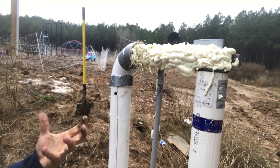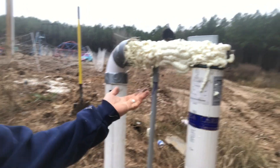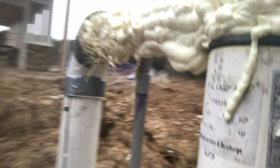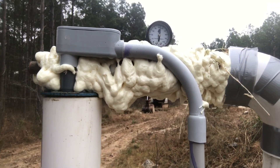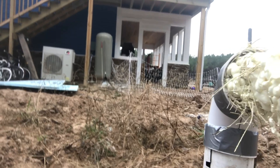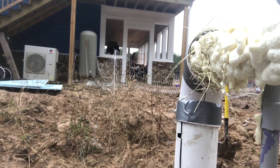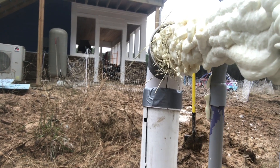You have to be careful because when you first put it out it's real runny — it'll just fall under its own weight — so you've got to give it some time to set up. Work an area, then move, work an area, then come back and work it. Underneath was the trickiest part; you can see how it really sagged here. But if we look up under there — it's all fully encased. Oh, there's a spot I missed — there it sagged. I'll come back and hit that. I've got one more can of foam. I'm going to come back through and touch up; first I'll fill this void here. I'll go around and touch up anywhere I can see bare pipe. Up there on the pressure tank I'm just going to throw hay over those, but if I have more foam I might just go ahead and direct-foam those as well. I want to make sure this out here is foamed really well, because I can throw hay over that and I'd be happy with it. I might go ahead and foam those pipes just because — foam them and then bury them in hay, why not? Got one more can to use up. I'm going to use it up and then call it done.